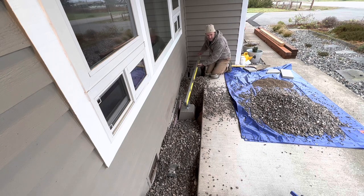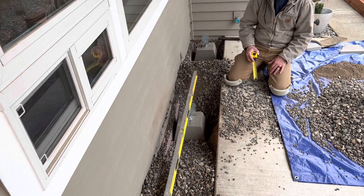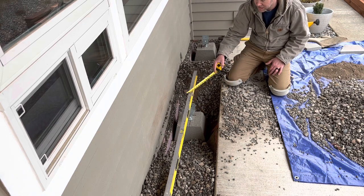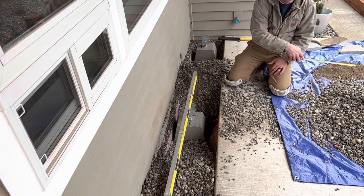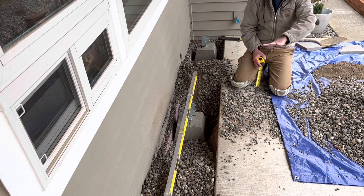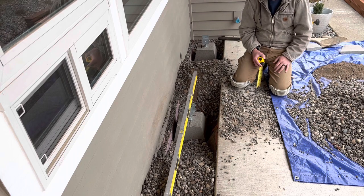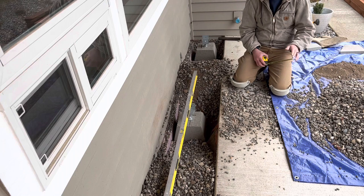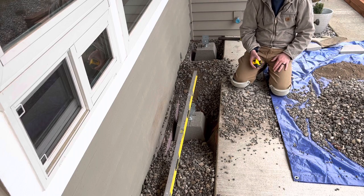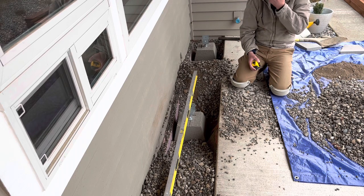Five and a half inches from the bracket to the top of my level — holy moly guacamole! That's convenient. So I know that when I set this beam, my joists are going to sit right there running this way. I need to set up another level so I can work backwards to determine the layout. It's difficult because this is sloping not just one way but the other way too, so it's going to be a compound rip-cut situation. We're going to have to set up string lines, lasers, or something — haven't figured that out yet.